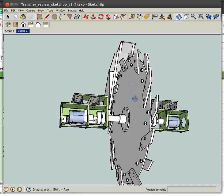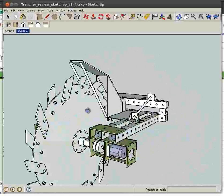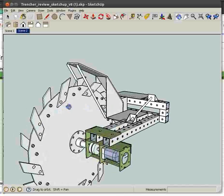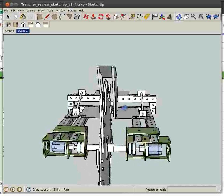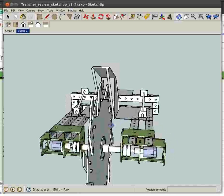We've got a five-foot cutting wheel with removable teeth. The teeth can be adjusted — you can put on narrow but staggered teeth to give you a one-and-a-half-inch cut width, or mount wider teeth and space them out more depending on what you need.